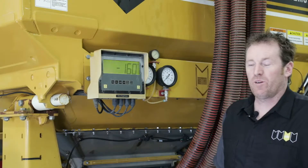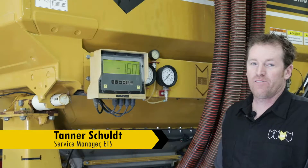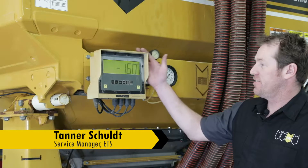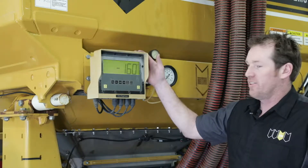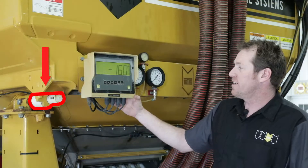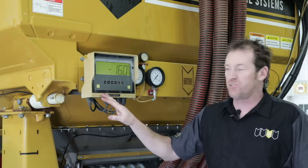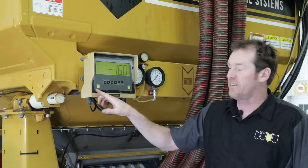This is going to go through a brief sequence of calibrating your Soil Warrior with two and a half inch load cells. This here is the scale unit; load cells are located at the corners of the tanks. You want to identify and turn on the scale. Remember there's a switch in the tractor to turn on the scale, as well as a power button here.